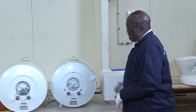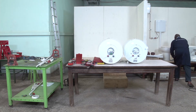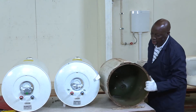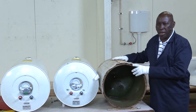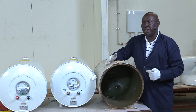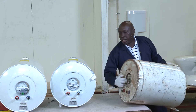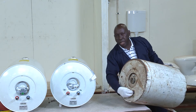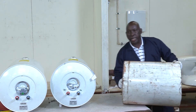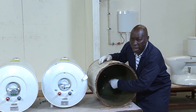I will take a moment and show you a sectioned old heater so you can see what we are talking about. This is a similar version of these ones, only a bit old, but we have cut it — truncated it — for you to see the inside details. The immersion heater I've been talking about is here, similar to the same new tanks. The same pipe connections are also here. This is the immersion heater — this is the one that heats the water.